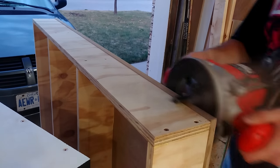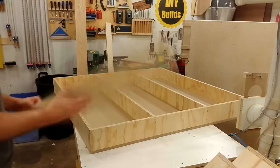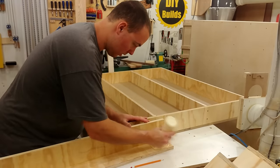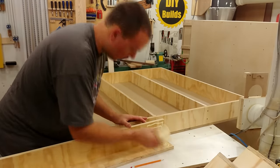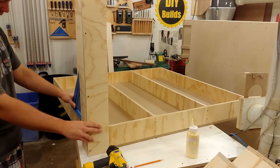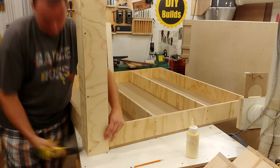The MDF was not exactly 4 feet by 4 feet, so I came back with a flush trim bit. To start attaching the legs, I first flipped over the top shelf on its top, marked out on the legs where I was going to apply glue, and then checked everything with a square before firing in a few brad nails. I then came back with 4 two-inch screws on each side of each leg.